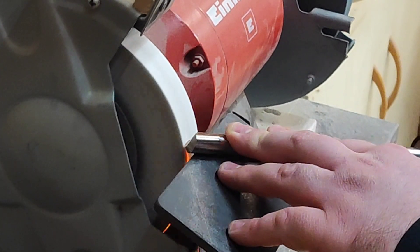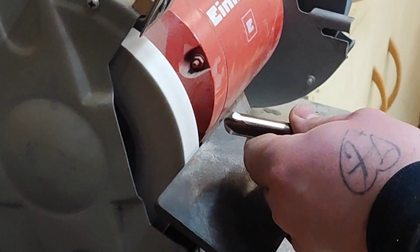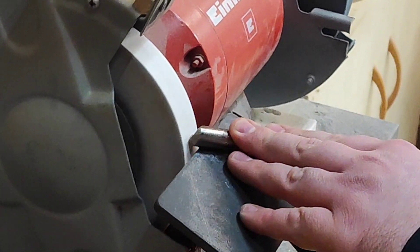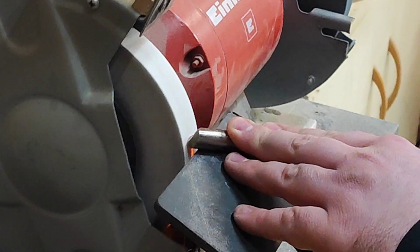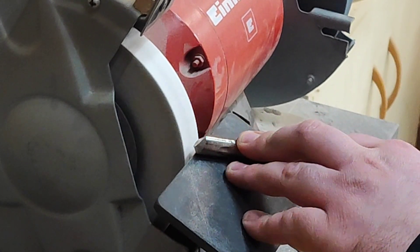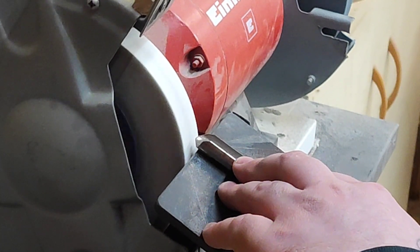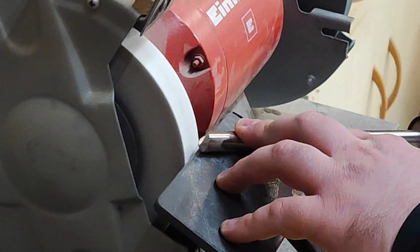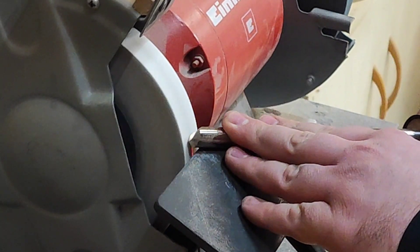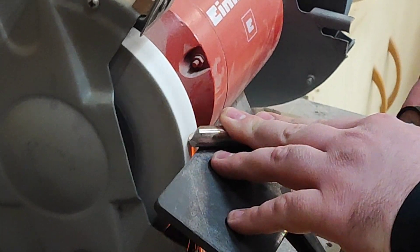Just a light motion. You can check it and cool it down if needed. If you have a CBN wheel you won't have to pull it away as much. When I'm done with the wing, I drop the handle and rotate the gouge in my hand to get to the next position, and the same obviously goes for the other side. I'm going to do the right wing first.